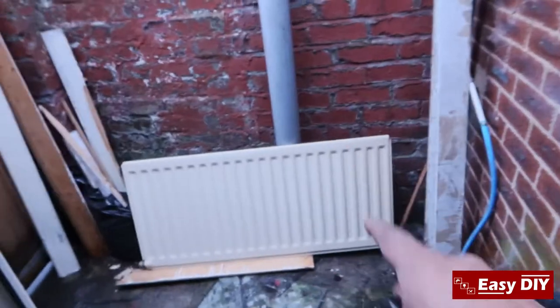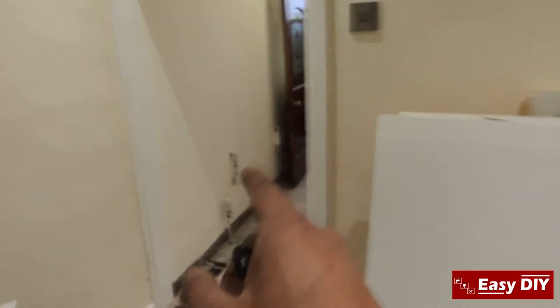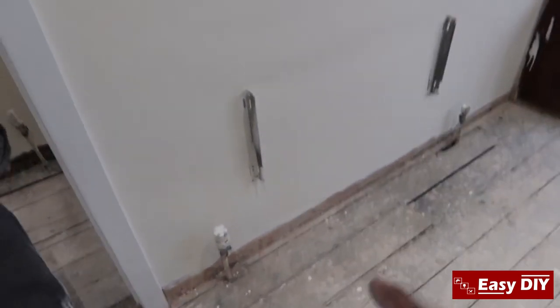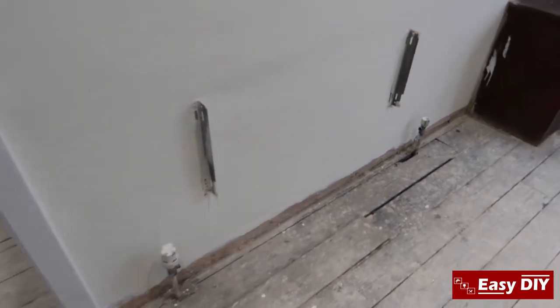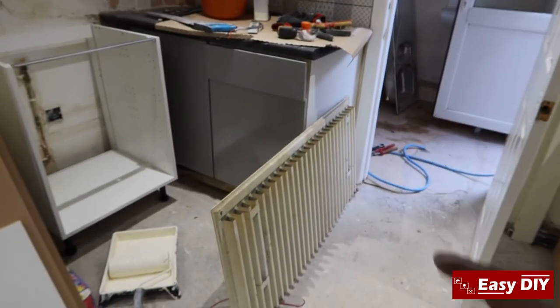There's another one I've already taken out and this is the one I'm going to be doing in a bit. I'll show you how you do this with a hose pipe. This is where the hallway is and I took that radiator out. The thermostatic valve is here and I've turned it off so there's no leak. We took another one out over there as well. I turned the boiler off, made sure they're all turned off. Before I put them back in I'm going to give them a good flush — get all the dirt out. You'll generate more heat and it's good for the boiler itself.